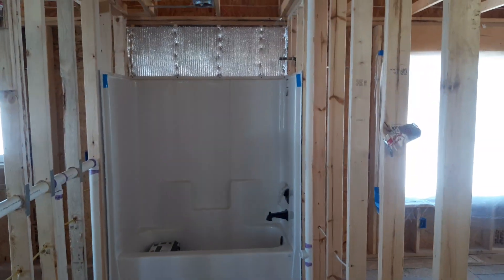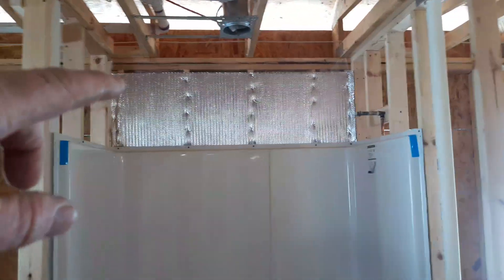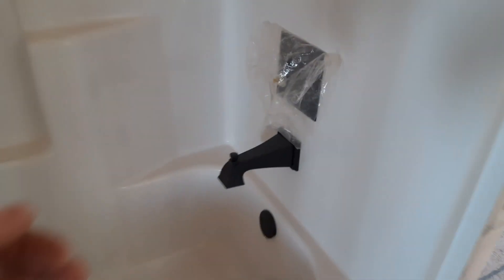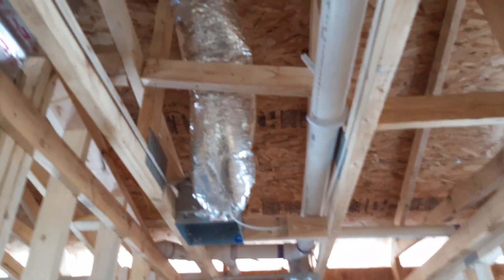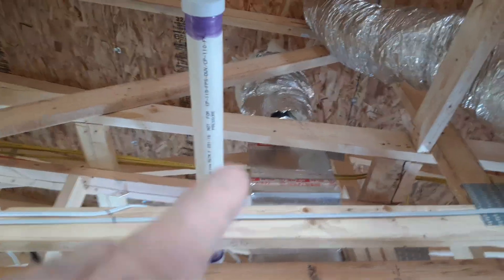You'll slide the door open and have access to the full bath: tub/shower unit 32 by 5 foot, a 2-foot linen, 4-foot vanity, water closet, single vanity. R21 batt insulation with 4-mil plastic and bubble wrap on the back for insulating volume. Delta accessories in black. Vent fans — 100 CFM vent fan, R8 through the roof. The kitchen range hood is 30-inch R8, coming down over that pan, with the insulation pack 18 inches up, going through the roof — fully insulated.